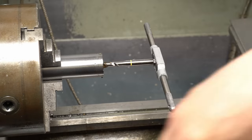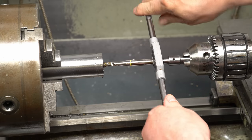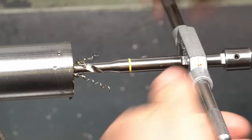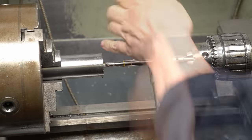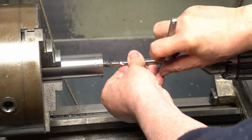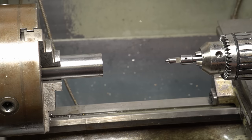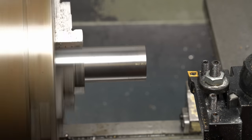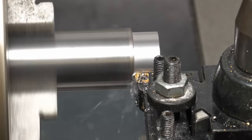The machine tap's got a short tapered lead in, so I drilled the hole deeper than necessary and cut the thread an extra 4mm deep so the spigot threads won't bottom out. I need a bit of relief for chip clearance, so I reduce the diameter of the rear of the boring head and then machine a slightly undersized section for where the tool's inserted to reduce the risk of chip packing during a cut.